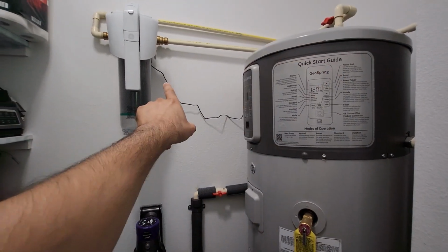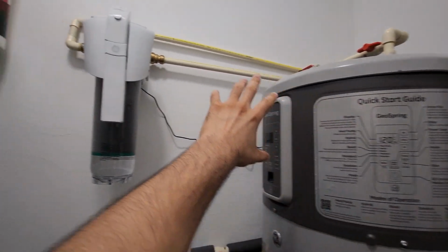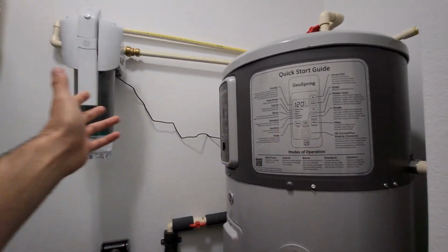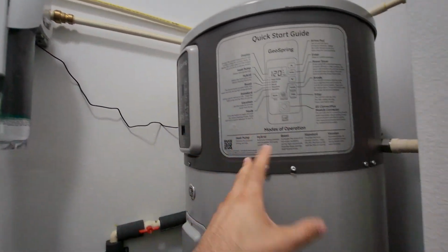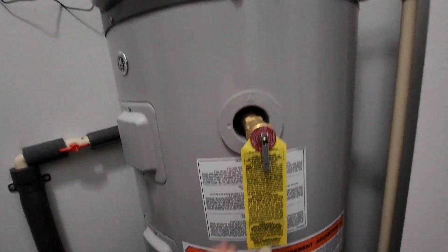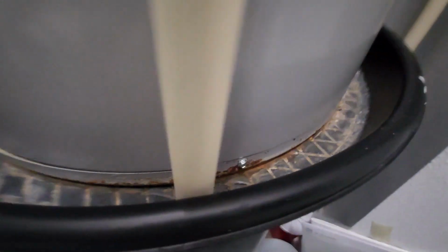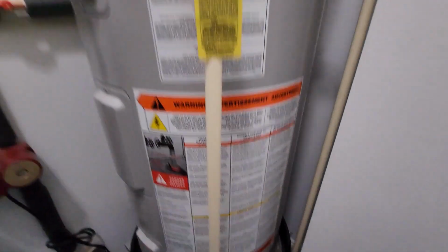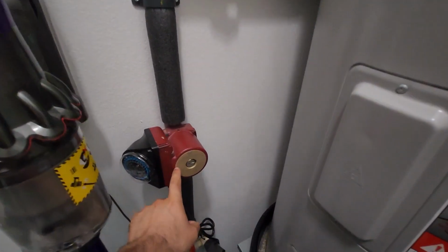So this unit kind of creates a problem, right? The water potentially wasn't able to backflow when there was a lot of pressure in here. Typically, I guess it's how it normally works, but the water was just flowing this way in one direction. So where did all that extra pressure go? Well, to the pressure relief valve, and it was spitting on out for a while there. But there's so much rust here, it probably was doing that before I installed the GE whole home water filter unit. So I don't 100% blame that, because this thing came with the house.